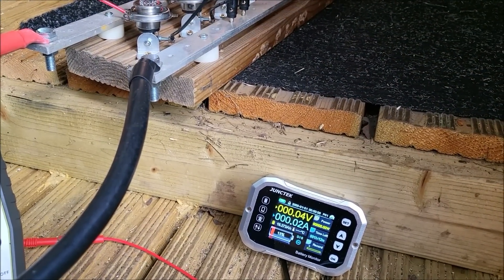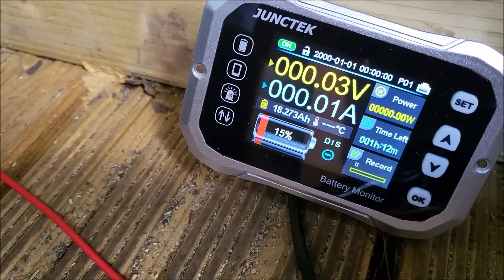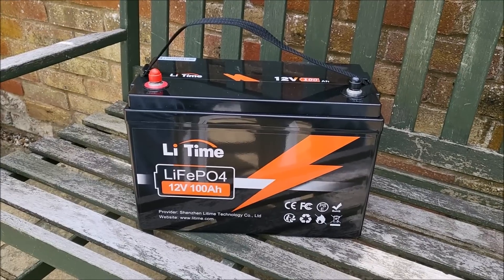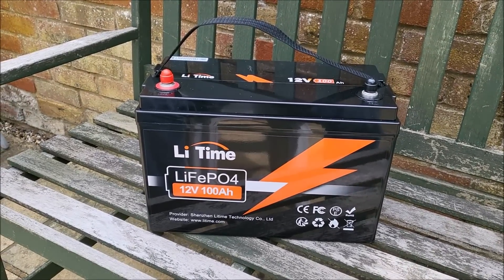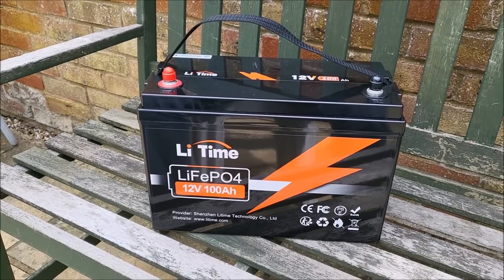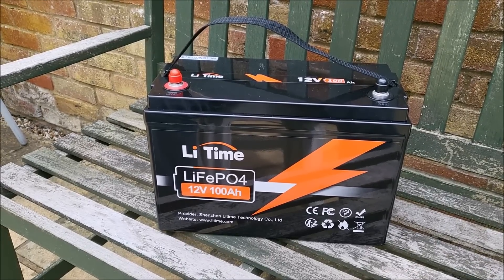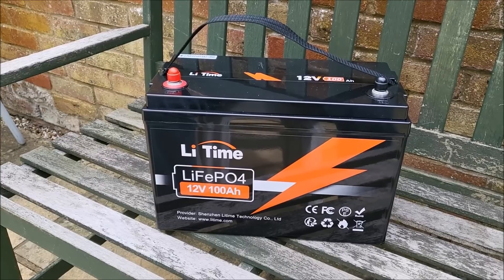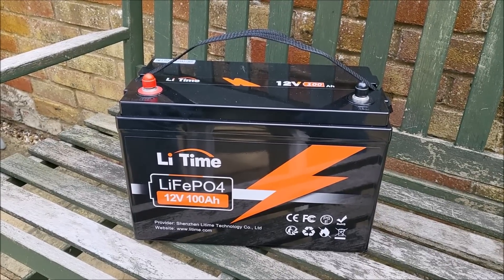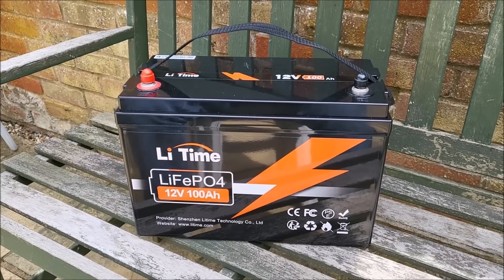There it is — I think it was about 10.3 or 10.4 volts. And the final result is a little bit under 102 amp hours. So that's the Li-Time LiFePO4 12.8V 100 amp hour battery — it is 100 amp hours, in fact just shy of 102 amp hours. It's very easy to charge; you can't really go wrong as long as you stay within the 100 amp charge current, because the battery will simply cut off charge if one of its cells goes over voltage. You can discharge up to 100 amps, and 280 amps for up to 5 seconds. As Li-Time say on their website, if you wanted lead acid with the equivalent capacity, it would be about 5 times the weight. Links for this battery in the description below the video. Cheerio.